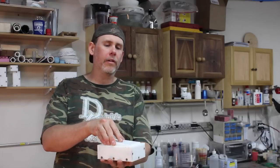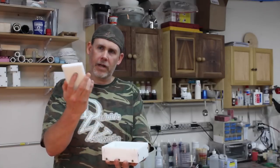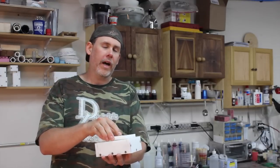All right, so once you've stabilized or dried out the beans, they're ready to cast. Now, the only difficult thing about casting coffee bean blanks is they float. And you really want to pack them into your mold as tightly as you can, but it's kind of hard when they're just floating and separating in the mold. So the thing that I do to combat that is I just have a little piece of HDPE, high density polyethylene, so it's non-stick, and I just stick that on the top of them.